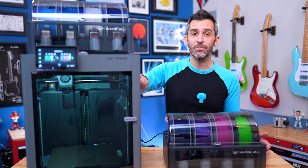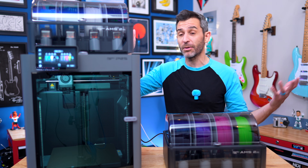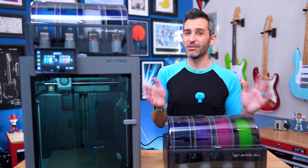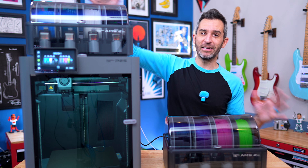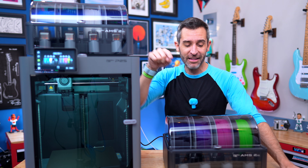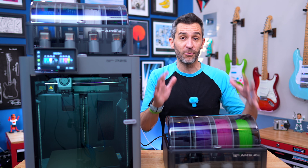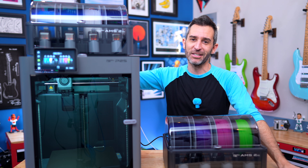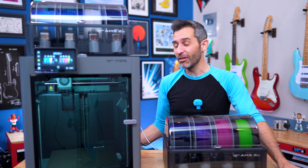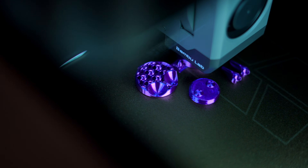Right now both AMS units and the printer itself are all running off the same power supply. Drying heat takes a lot of power, so having both use their dryers just isn't really practical or safe. You can add an external power supply to one or both AMS units and then you don't have that drying limitation anymore. For me, that's not a huge part of my workflow. I want the expanded ability to print more things. If you're jumping into the world of the P2S, having the four-spool AMS is amazing — this second one is purely a luxury. It's a great place to store four extra spools, and the versatility of printing with eight different colors and materials is awesome. The fact that all of this takes up only one outlet in the wall is really cool, so I'm okay with that drying limitation.